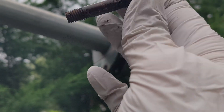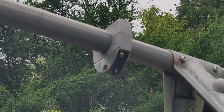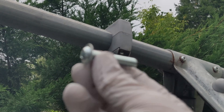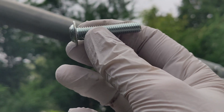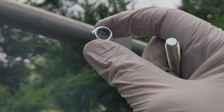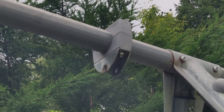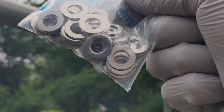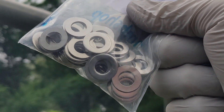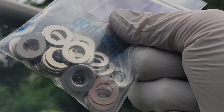So I'm going to replace that bolt and pack it so I can clamp it up tight. What I have here is a flange bolt, a stainless steel nylock nut — all M8 metric — and a whole bunch of 8mm stainless steel washers. I'm going to put this back together but pack the bearing on each side so that when I tighten the bolt up it will actually clamp it properly.